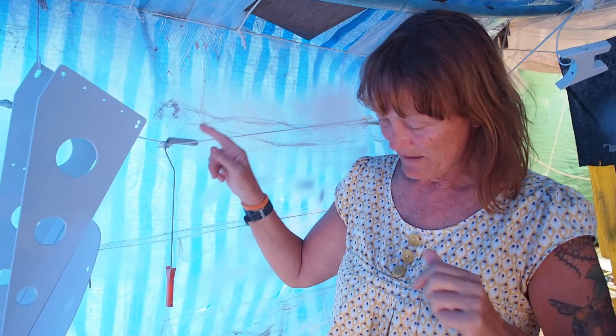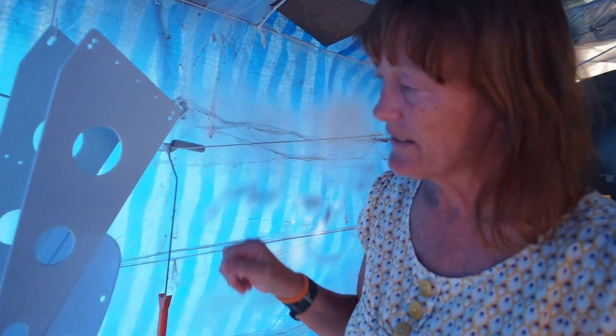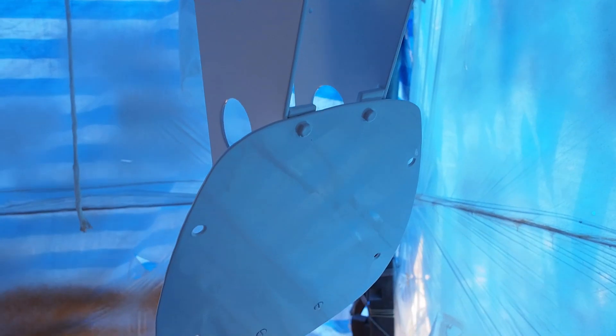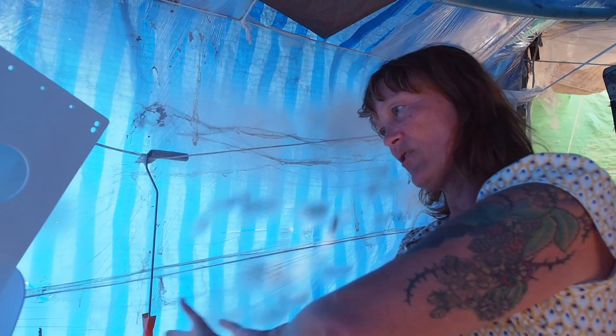But the main thing is this structure here — this is the support for our radar. The old radar sat on a smaller base. Because we've now got a new radar as part of our whole BNG navigation equipment, we had to remove the base. The machine shop cut a new piece to fit exactly our new piece, put it back on to these struts that go onto the mast, and the new radar will sit on top here. All done in a week. Done and ready.